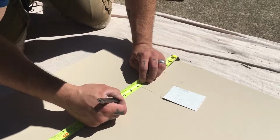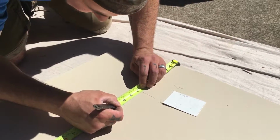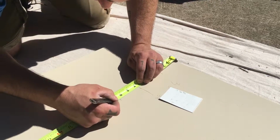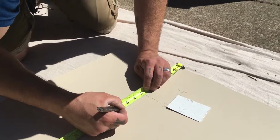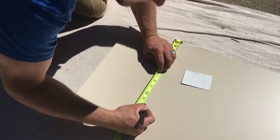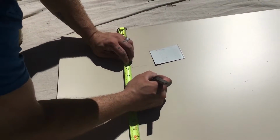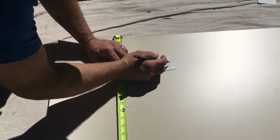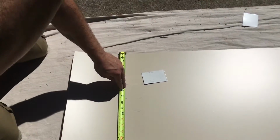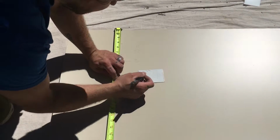And so then 2 1/4. So I add the quarter, 9 and, wait, sorry, 1/4. 9 5/8 plus 2 1/4 is gonna be 11 5/8. 11 5/8. So that's the last measurement, so that's a cut. 11 5/8, and that is the top. Exactly. Because remember, the top is only 2 measurements, it's not 3. So the rest of these get a little funkier.